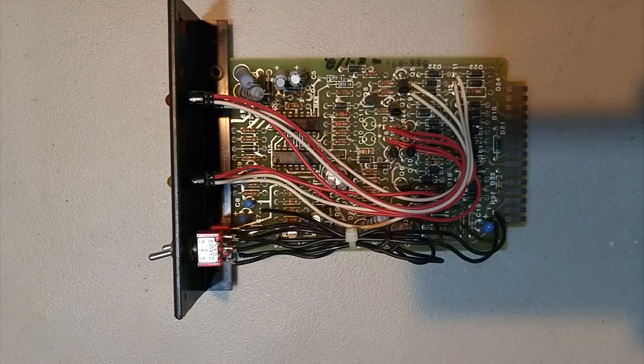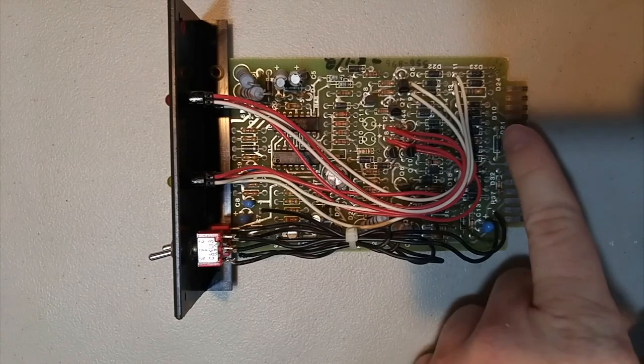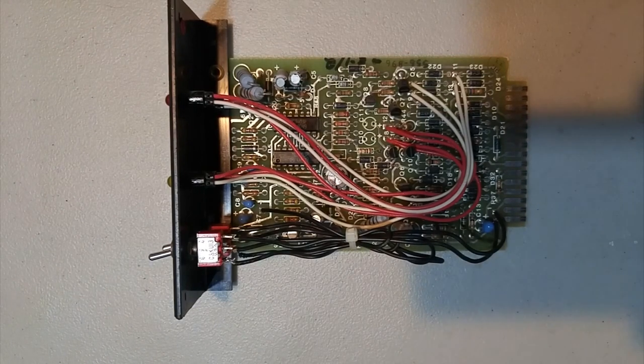So there's a circuit inside this panel which measures the zone and detects a dead short or an open condition. When it detects an open condition, it causes a trouble, and when it detects a dead short, it causes an alarm. Now, how these panels do that is actually kind of neat. There are some circuits which run through the entire panel and connect to all of the cards. There's one circuit, which I call the alarm circuit, where if a zone goes into alarm, it applies power to a contact, which puts the panel into alarm. It sends power to the main control card, which puts that into alarm. And then the main control card does its thing.